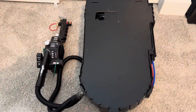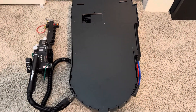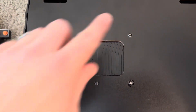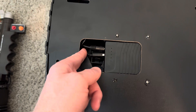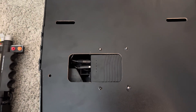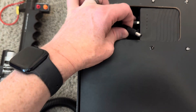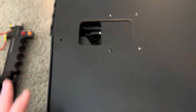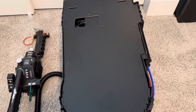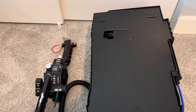So just a quick look at the back here. This is the stock back of the Spirit Life-Size Pack and you'll immediately notice there is a Talentcell battery pack up there, which is actually bolted in. It has its power switch and then a USB and 12-volt connector coming out of it to power the amplifier, main pack board, and all the lighting. To charge the cell I can just pop it out and plug the charging cord right in. I'm trying to get away without doing an Alice frame to save money and keep the weight down.